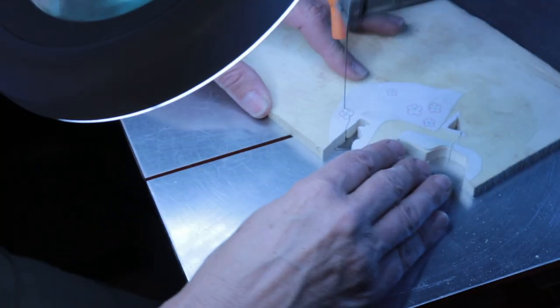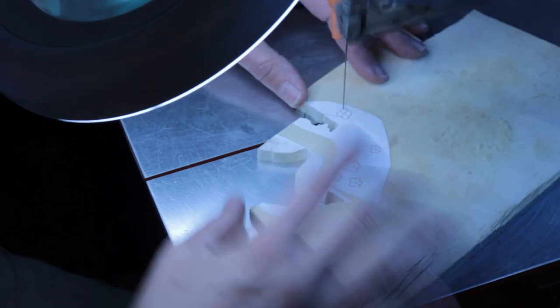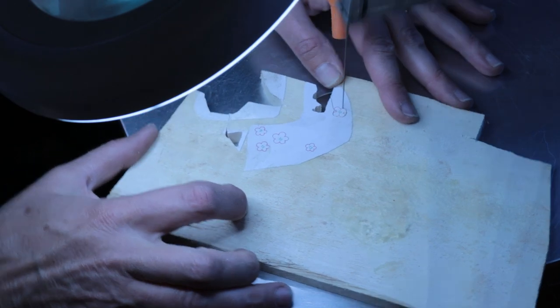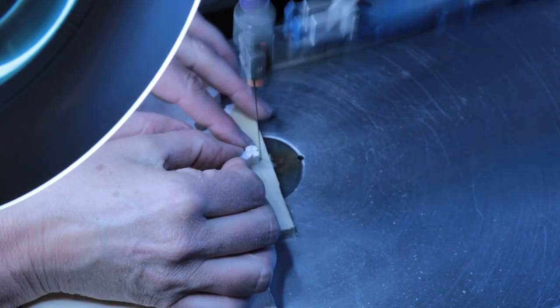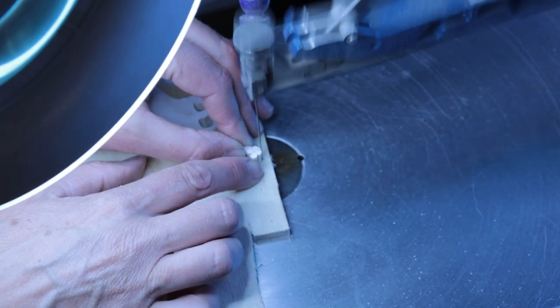The flowers were so small, so I cut as much as I could and then I left a long handle on the wood. Then I double-stacked the wood, which acted like a zero clearance insert, so I could cut away that last little bit and then cut away the handle.